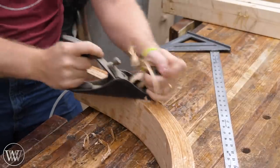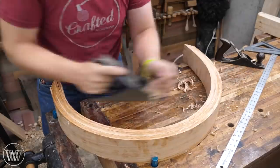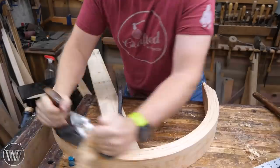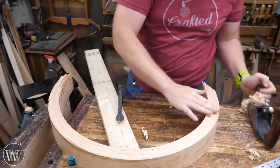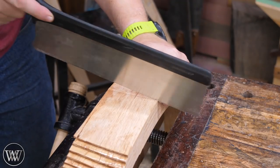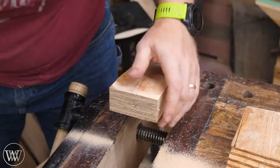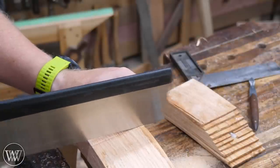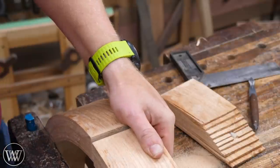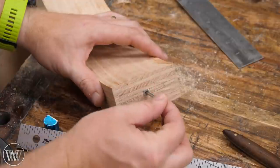Now we need to plane this down - smooth it out, get rid of all the epoxy that squeezed out. We come in with a scrub plane to get rid of all the epoxy on top, then a rough plane to smooth it down, and then a smoothing plane to detail it out and get a nice smooth surface. With this rocking motion you can get all the way through and get a nice clean shaving all the way around. We start by making one cut straight across so it's 90 degrees to the end grain on the curvature. There you can see the hose running through the middle. We're going to cut off the other end and then cut this in the middle into two even pieces - about 15 inches long each. The hole runs through the middle so I can put a cable in.